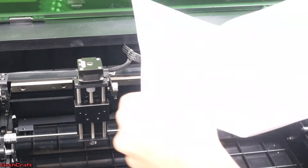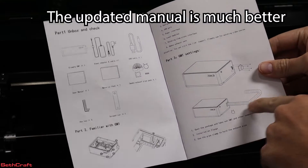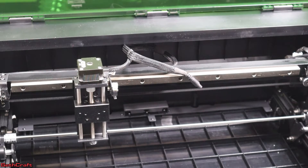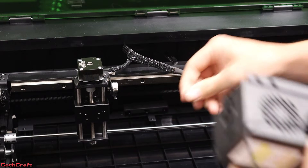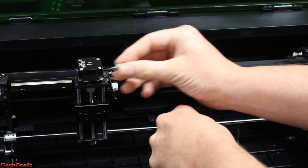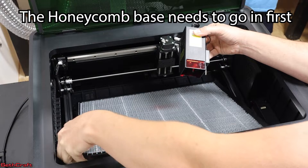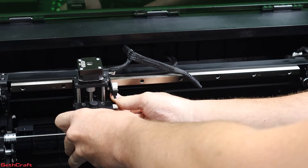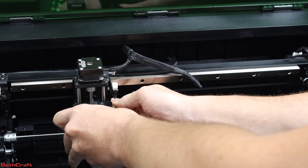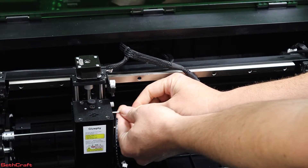Let's begin the assembly of this laser. The instruction booklet is very vague — it has more information on how to install the tube for the exhaust but nothing about how to install the laser. Looking at the laser, it's got a couple of screw holes on the side of the z-axis, and there is a thumb screw which must go in the upper right-hand corner because this is what's going to activate the limit switch. I'm going to set this module in place, get the thumb screw screwed in, and then use these small screws to get the rest of the support installed.